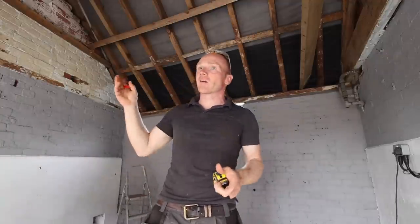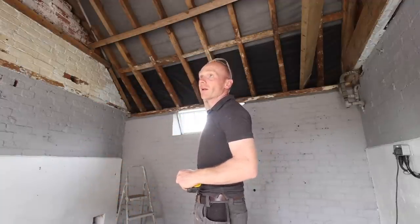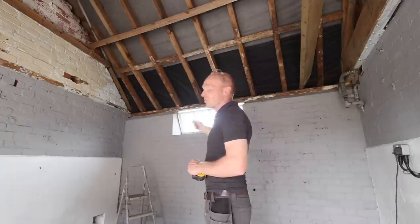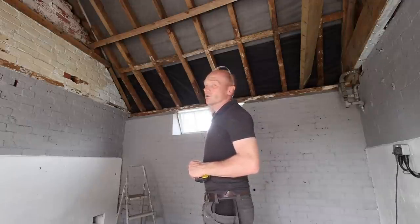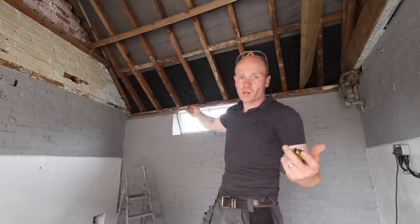Such a shame - I think it's all that galvanized sheet that was up there. All of these wall plates got to be replaced, the whole roof arguably, because when you start replacing the wall plate I'm guessing we'll have to take all those braces off. But it's just super soft over there - it's structurally okay for now.